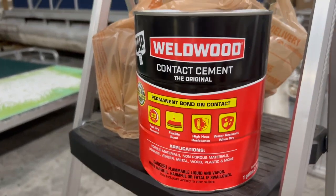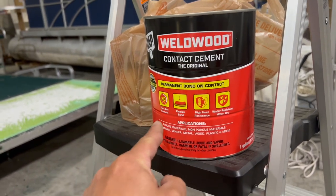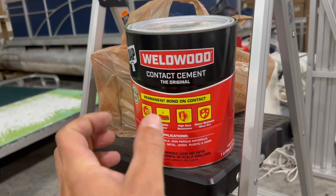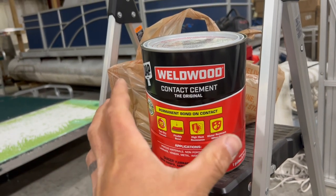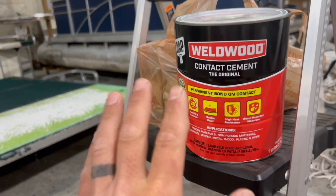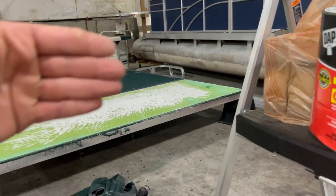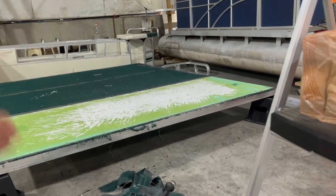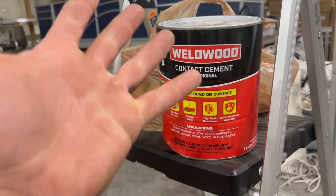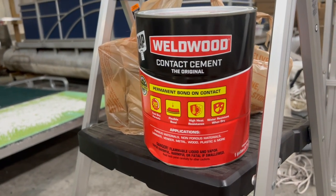This is the contact cement, or what you'll hear it called, a solvent-based adhesive. The way this glue works is there is solvent mixed in here - it's real liquidy, almost like a paint consistency. The solvent is keeping the parts of the glue that stick together apart. So what has to happen is I have to apply this to both pieces of material - the deck and the vinyl - and then wait for it to almost dry. Then I stick them together, working in small sections about one to two foot increments across the entire deck. We have to let the solvent dry or evaporate out of the glue, and that's what allows the two pieces to stick together. It says right here 'permanent bond on contact' - that's no joke. When you stick it together, it's stuck.